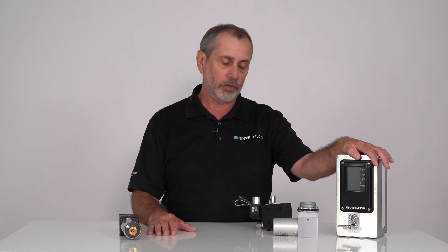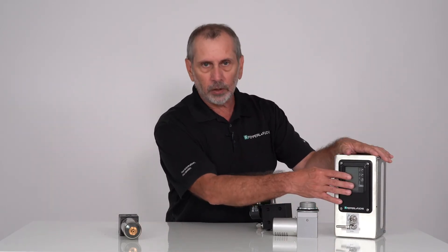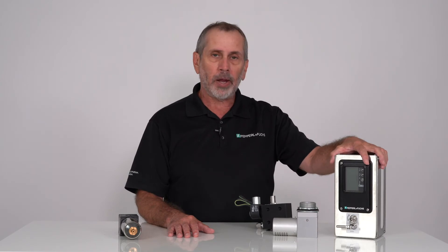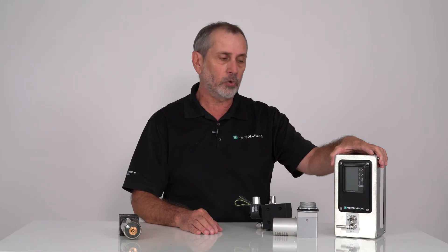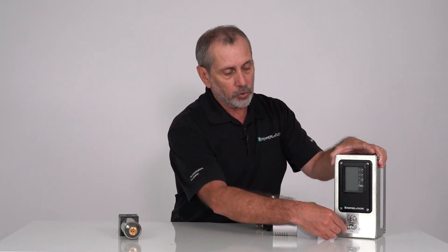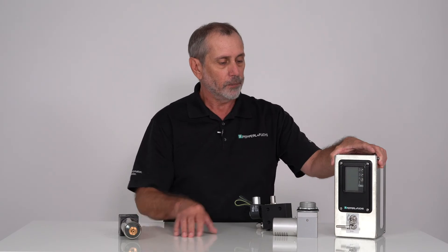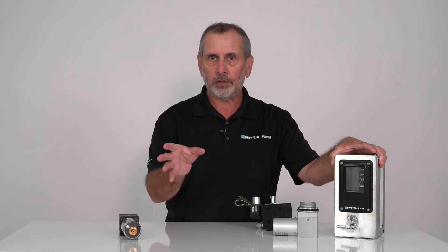The 7500 offers many options that the 1000-3000 series does not. It has a nice user interface display for different programming. The 7500-MTD is all manual — it can be mounted on an externally mounted system or as a panel mount. These units are mounted with a ball valve and needle valve manifold system just like the 1000-3000 series: ball valve for purging and needle valve for pressurization. It does exactly the same thing manually — you open up the purging and then pressurization takes over.